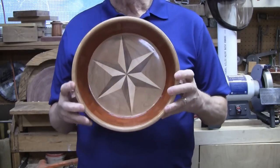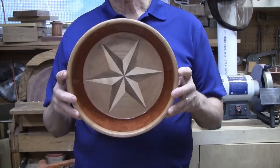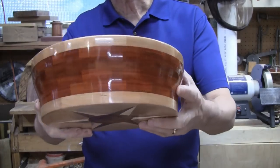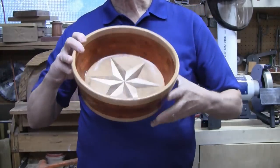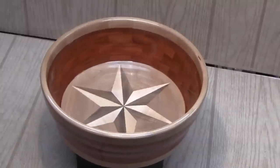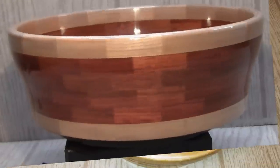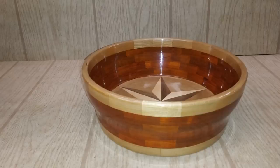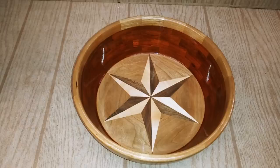I finished it with Minwax water-based sanding sealer — two coats — and then five coats of Minwax polycrylic. I think it's a nice finish. Because of the wood in here, I wanted to give it more depth, so I used the Axe abrasive paste and polishing paste to bring out all the depth I could in that padauk. I'm really happy with that. I hope you enjoyed the video. If you like this video, give it a thumbs up, leave a comment, and hit the notification bell so you'll know when I have a new one out. It would also be great if you could share my videos. Thanks to all of you who are subscribed — it means a lot. If you're not subscribed, consider doing so. I do many types of turnings, from segmented work to natural turnings from pieces of trees, and I put out videos weekly. Thanks again — until the next time, see you later.